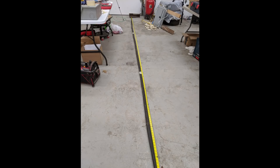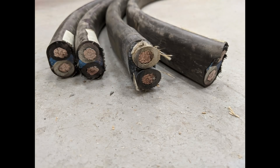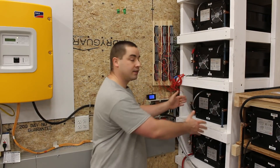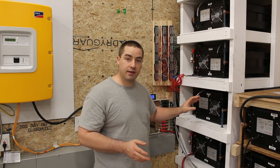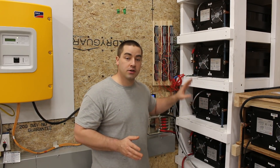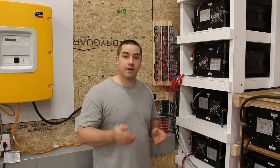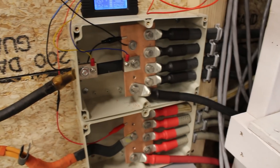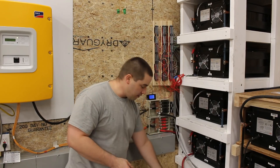First off, I crimped all of my battery cables — four positive and four negative. These cables are surplus military jumper cables. To recap, in this tower next to me I have eight modules, each module is 24 volts, and they are paired together to create 48 volts. So I have four 48-volt batteries, each with a positive and a negative that needs to come down to a central bus bar. I made sure they were all the same length so that the battery in the middle of the rack would be used equally as the ones at the top or bottom.